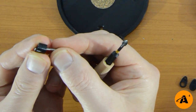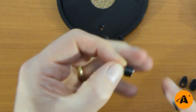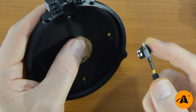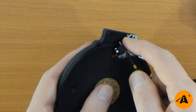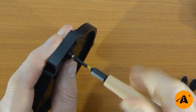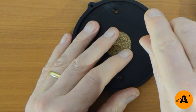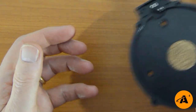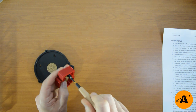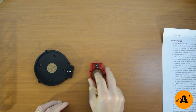Then put another super tiny bearing in that side, and now take a 12-mil long M2 screw — again a very thin screw — and slide that from underneath. The trick to stop it flying about is to hold it like that and then screw it into the hole. Screw it till it's kind of tight, and then the very important thing — loosen it off just enough so it moves freely. Do the same on the other one. Now there's the other one. So that's looking good.